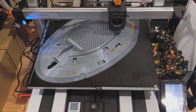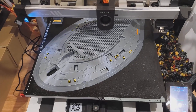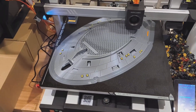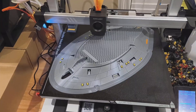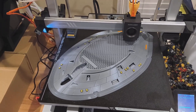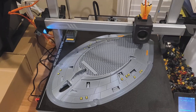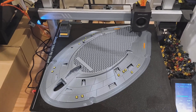Friday night, just about to head to bed. We're up to layer 403, 81.79% complete. Everything went well apart from a stoppage — the red filament broke in the tube when it was supposed to retract. It didn't retract properly, so I had to clear the tube, re-thread the red filament, and off it went again. All looking good.